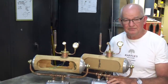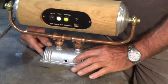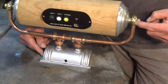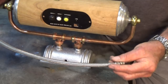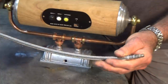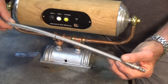Let's get on to the first part: getting the power from the base to the clock case. If you recall back to one of the earlier episodes, I drilled and counterbored for a 5-volt DC power socket in this cast aluminium base. The idea was that the wire from that socket would come up through one of these T fittings, through the tube, and into this end of the clock. But that was a bit of a problem — getting the wire through this banjo fitting and into the clock body was a mission. So I decided against that and instead I'm going to use one of these flexible rubber plumbing fittings, designed for things like kitchen sink or bathroom mixers. They're quite flexible, pressure tight. This end has a 5/16th UNF thread on it, and this end's got a hex nut on it as well, but it's way too long and I'll need to shorten it.